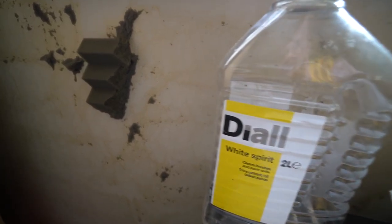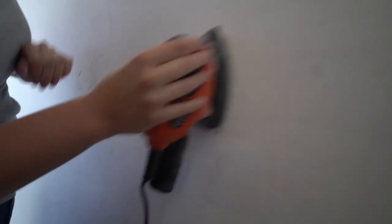But that was the first mistake. The problem became very transparent when we tried to take them off. It took two or three days of hard work stripping the walls. There were lots of bits with glue residue, and the problem with glue is it's not flat — it raised the surface of the wall, made it uneven and bobbly. It was impossible to easily clean off. I ended up having to use an electric sander, and it just took ages to try to smooth the surfaces out and get rid of the glue residue.